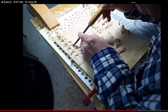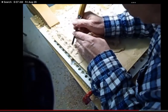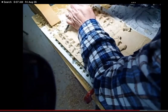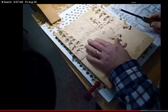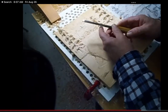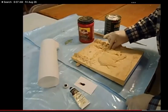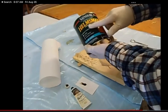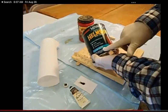To finish I'm going to use a polyurethane and for building the shadows I'm going to use artist oils. When I put the finish on it doesn't necessarily have to be all ready for finish because I do some carving when I'm putting the finish — I'm seeing how it takes it. We're getting ready to varnish and I'm going to be using the Helmsman, it's an indoor outdoor varnish polyurethane, it's a clear satin.